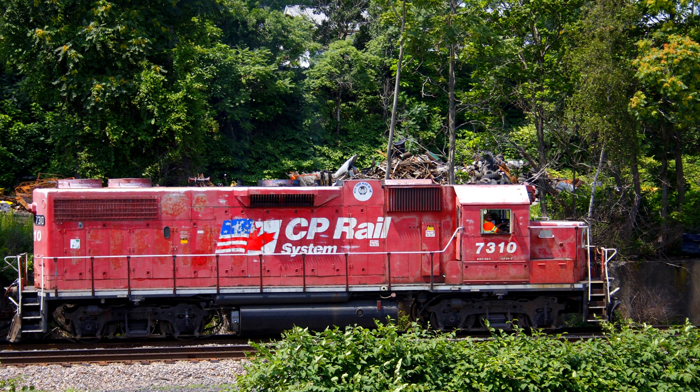With these new designs, the 2,000-horsepower GP38-2 proved to be a very reliable locomotive. Weighing in at a nominal 269,500 pounds, these -2 variants were outfitted with four General Motors Model D77 traction motors, AR-10 generator, D14 alternator, and could be optionally equipped with dynamic brakes. With a truck gear ratio of 62 to 15, the Jeep could attain maximum speeds of 65 miles per hour and had a starting tractive effort of 61,000 pounds and a continuous tractive effort of 54,700 pounds at 11.1 miles per hour.